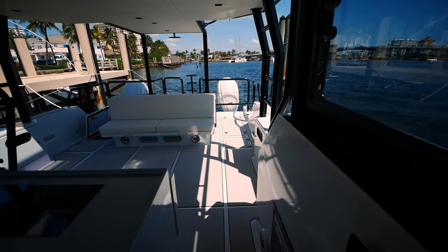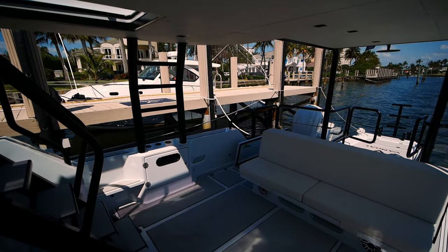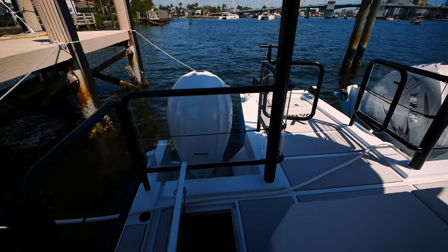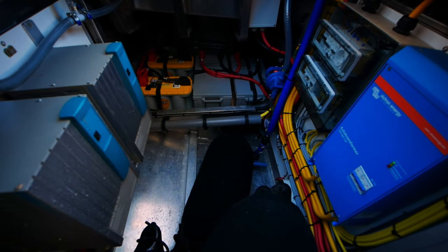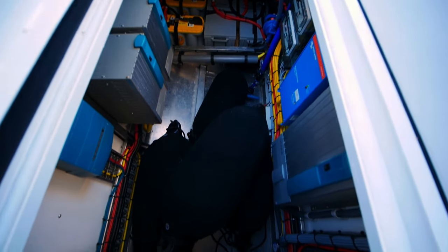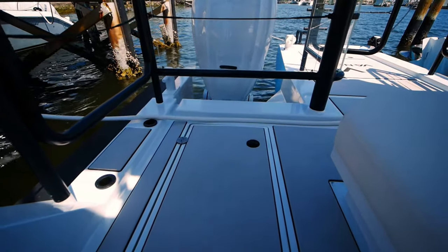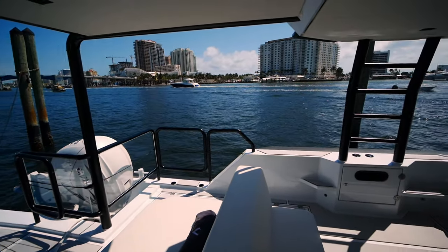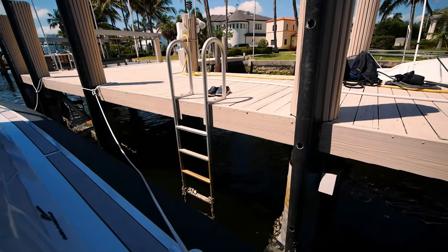As for the actual performance, she can go pretty fast. The top speed is 40 knots, which comes out to a little under 50 miles an hour. The range is 250 miles and she carries 330 gallons, so efficiency is about 0.9 miles per gallon. The mechanical space houses the electrical system, the transformer inverter, and the battery bank, while the opposite mechanical space houses a genset. For typical cruising, 25 to 30 knots is the range — 27 is the sweet spot — so she's really designed to cruise closer to 25 to 30 rather than flat-out.